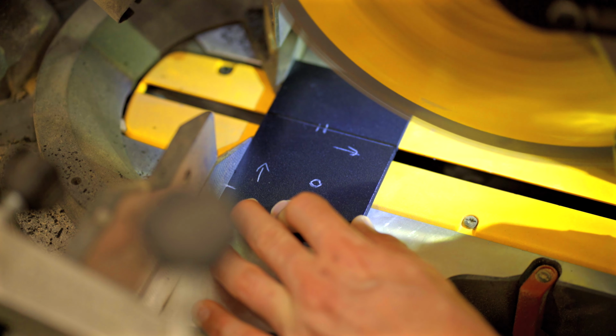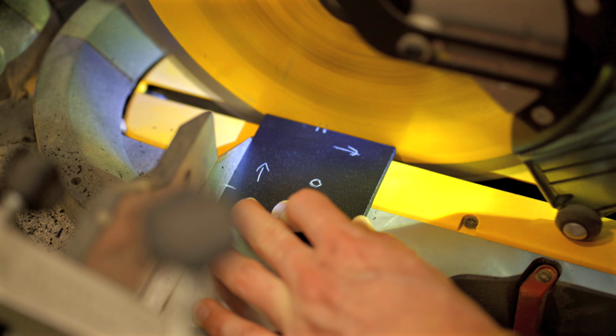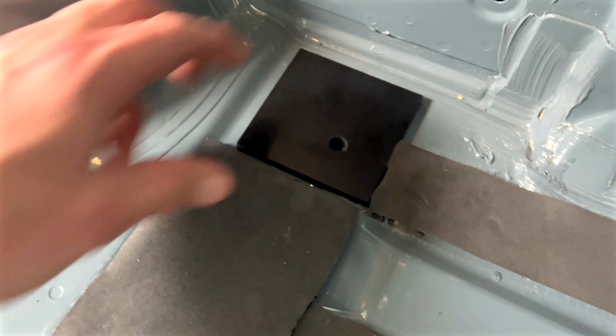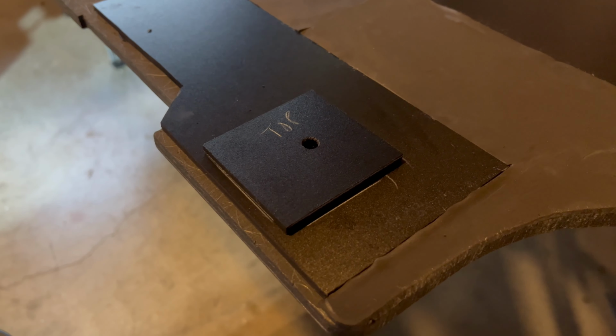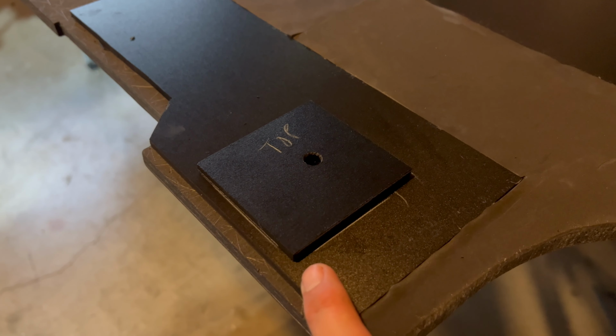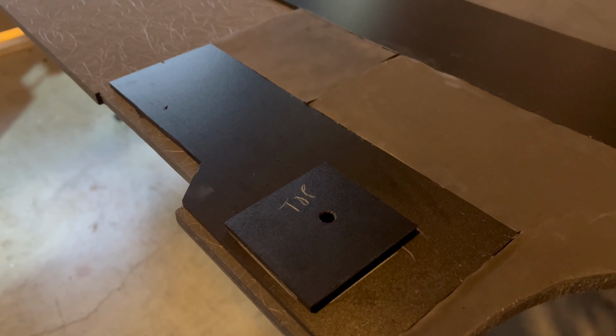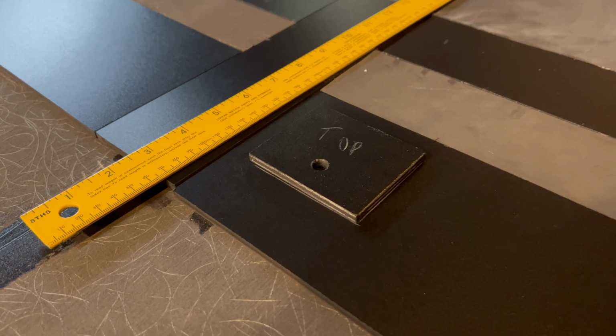The last thing I did to finish this step was to cut these little spacers for the anchor points around the vent. These give extra support in the low-lying areas. I used the holes themselves to get the position correct on where they needed to line up and to make sure they didn't collide with any of the nearby ribs.